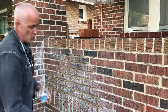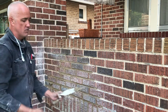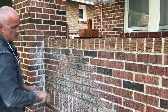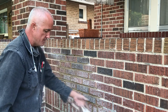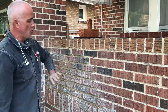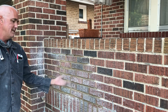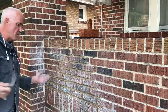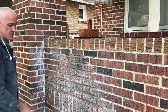This little section of wall — since it's cool today — I did it by hand, meaning I took a trowel, put mud on the underside, and tuck pointed it in. Then I picked it up to do the head joints, using a slicker as a tuck pointing tool. On a cool day your mortar won't dry as fast, so you need to let it get a little stiff before you strike it. If it's wet it pushes in too far.